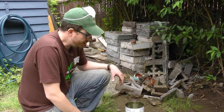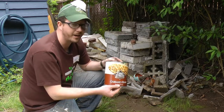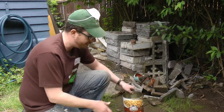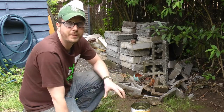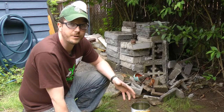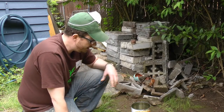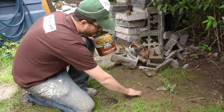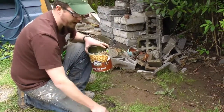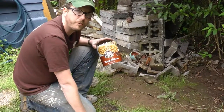The way we do one of these soil infiltration tests is you take a large coffee can — or in this case a garbanzo bean can, whatever you can find — and find a place of soil that is nearby where you plan to depave. The closer the better so you can ensure you're in the same soil type area. You want to make sure that all the grass or most of it is pulled away, because grass or other plants are going to affect your readings.